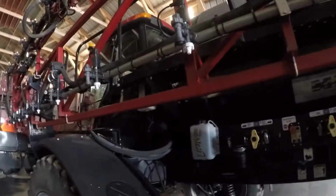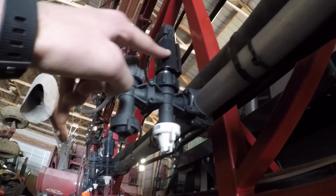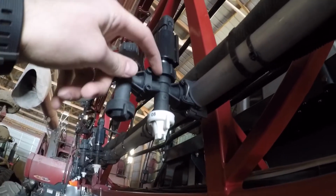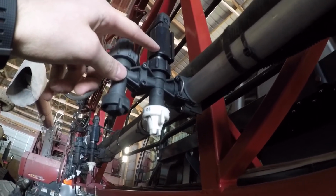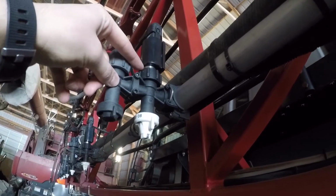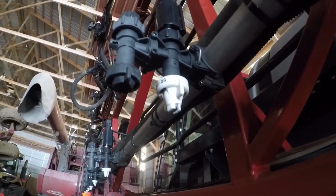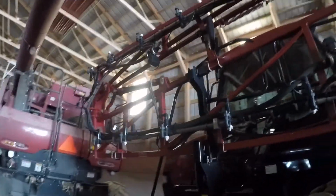Looks pretty clean. And here's what the Aim Command Flex system looks like. It's got a pulsing solenoid up in here that pulses up and down. I believe the solenoid is in here. Yeah. So then that pulses up and down, and that basically controls your water coming out of our tip right here. And we have 08 Wilger tips on here. I believe they're MLRs, nope, SRs. So, like I said, all brand new systems to me, but I'm looking forward to learning along with you guys.